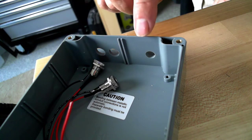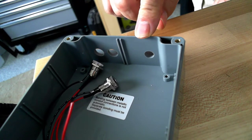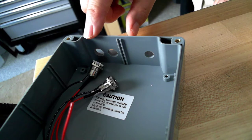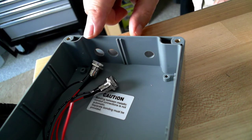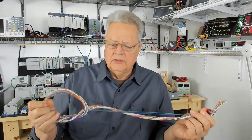This third opening over here is for the flyout leads to leave the box to go to the I/O on your controller. So I'm going to install those two bulkhead connectors and then come back, and we're going to continue on with this project. Continuing on with this project,